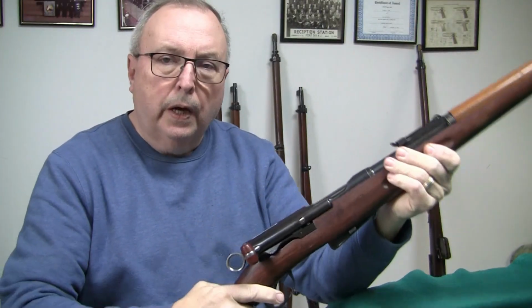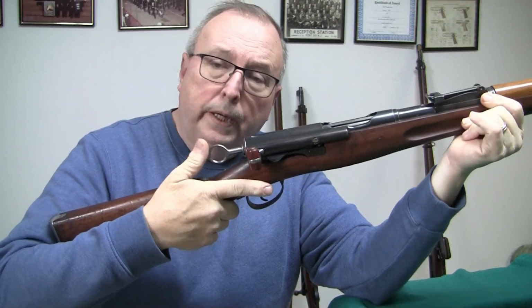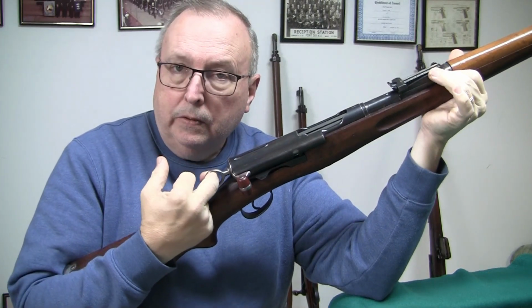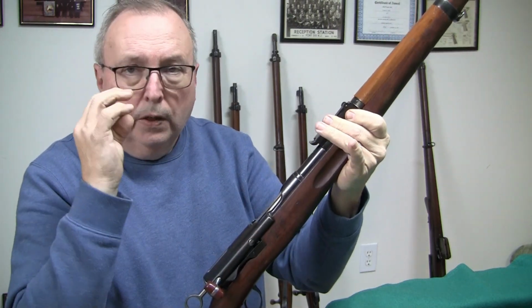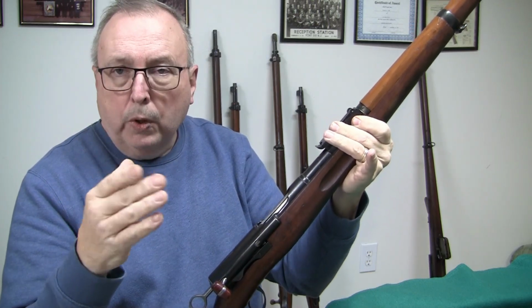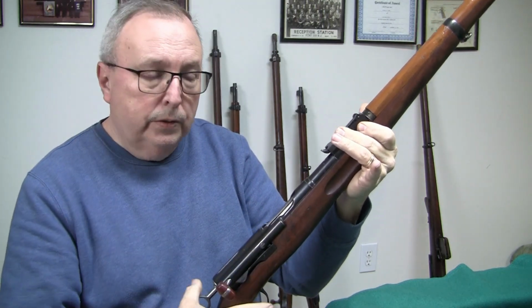Okay, we take this particular gun out for the first time and fire it. All right, clear the weapon. Outwardly the gun's complete, looks fine, functions fine. Doesn't look like anything's wrong. It gets light strikes or almost no strike at all. So, what does that tell you? The gun looks to function, you pull the trigger, and you're hardly getting a strike or no strike at all. It appears then that the firing pin is broken or the tip's ground off or something. So you've got to think, what's the problem? Firing pin.